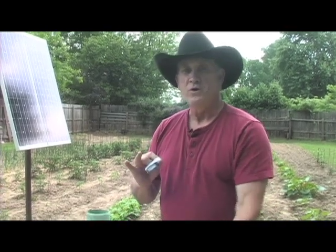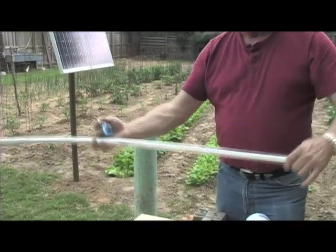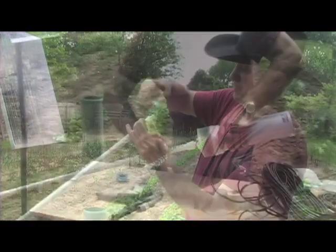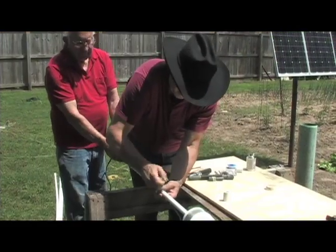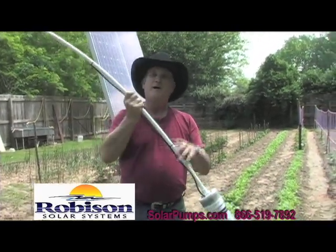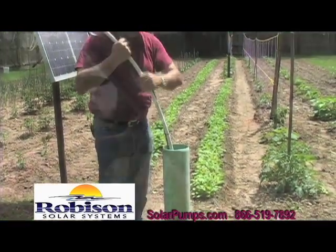One thing I like about the Robeson Solar System — everything's complete and it's already done, except for your pipe and fittings, because you don't know how far each well is going to be. First thing I do, I'm using PVC white pipe — put a little fitting on it here, go ahead and put a little Teflon on it just to make my connections a little better, screw it right into the top of the submersible pump. Put a zip tie about every three or four feet. Now we've got the pump put on the PVC pipe, the wire tied up, and we've got it zip tied all the way. Now we're going to insert it into our casing and put it all the way down to your mark.